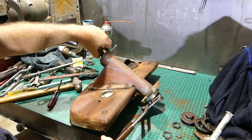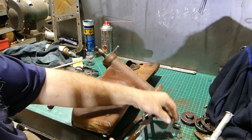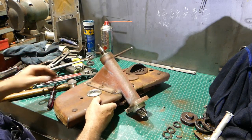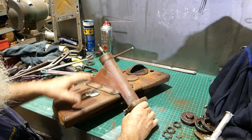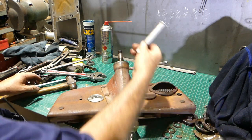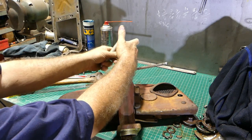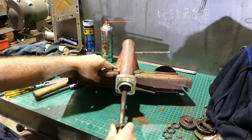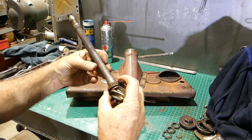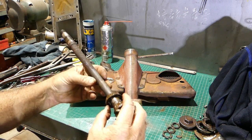This will undo — very fine thread. This should normally just bump out. I'll put it over near the edge of the bench and use an aluminium punch. And there we go — there's a lovely looking bearing. Just beautiful. The gear does look in good order.